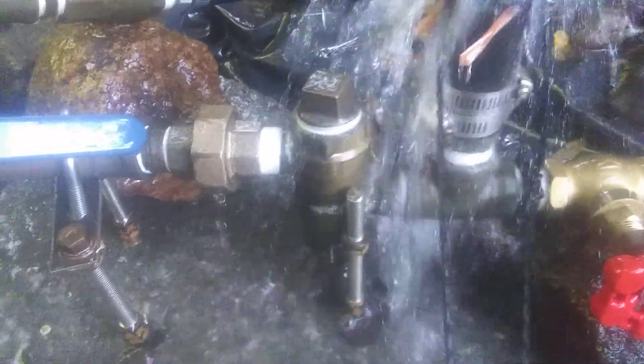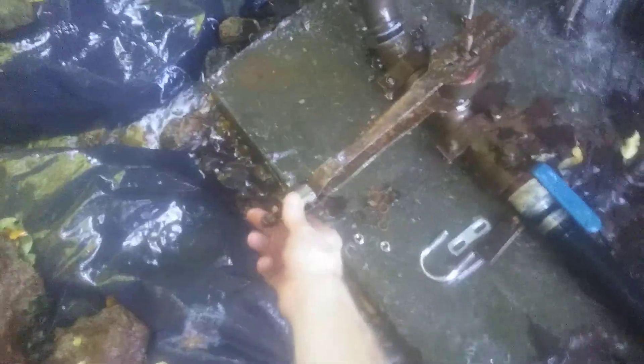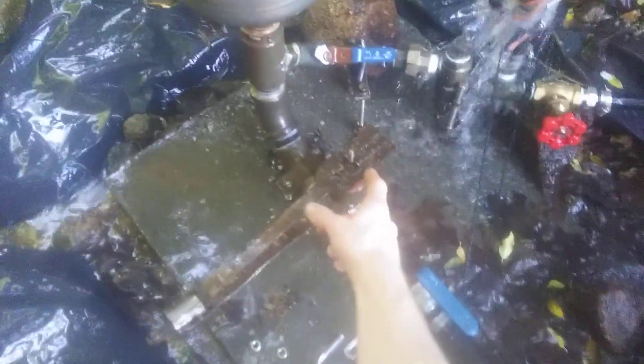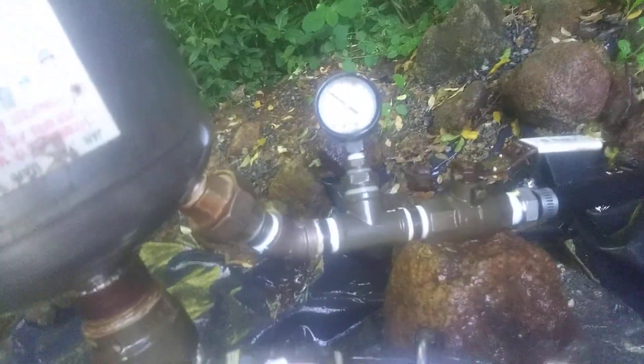This is a lift check valve that I made. It is a standard spring check valve with the spring removed. I drilled a hole in the bottom and a hole on the top of the valve seat — so the bottom side of the valve seat and the top opposite side of the valve seat — and I soldered in the connections so I can thread fittings onto them. That comes into the pump directly underneath the secondary inside valve. This is just a standard homemade ram pump. I have this custom waste valve, weights to change the weight distribution, and bolts to change the stroke size. Then of course you have the pressure tank and the delivery pipe on the back side connected to the pressure tank — that's what goes all the way up the hill.